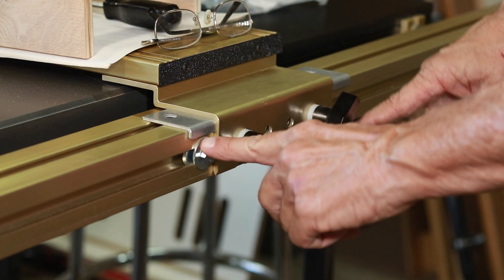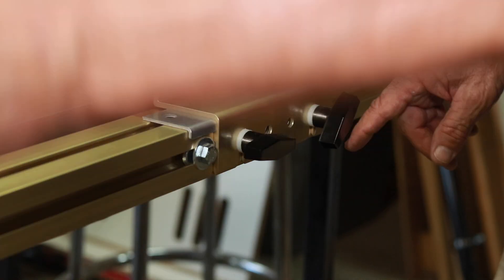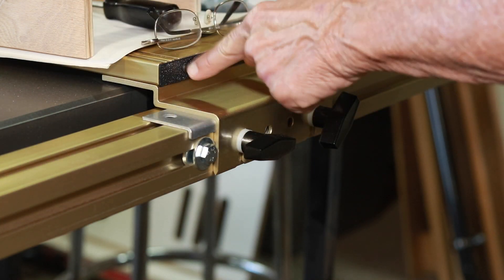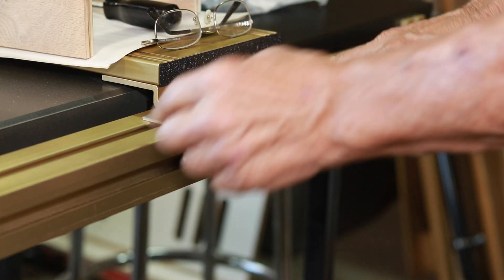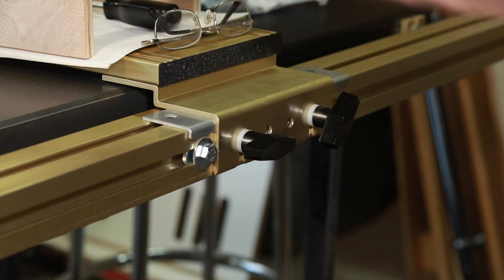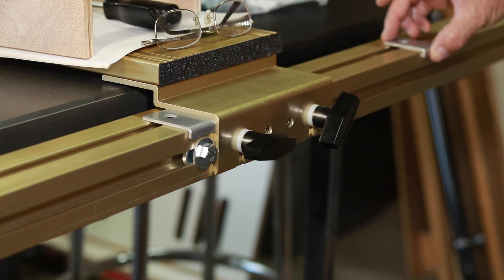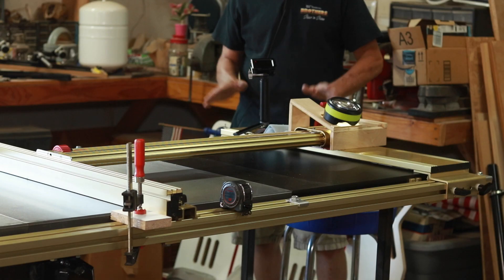So what we're going to do: I'm going to take the existing nuts and bolts out of this T-slot and slide them out. I'm going to reset the base per factory and make sure I'm at the spot I need to be, lock this down, then reinstall the floating stop as a permanent stop on top here. Then we'll go through the process of setting the fence at 20, moving the whole thing back, getting my mark for the backstop, and then make a quick test cut to make sure we're dialed in.